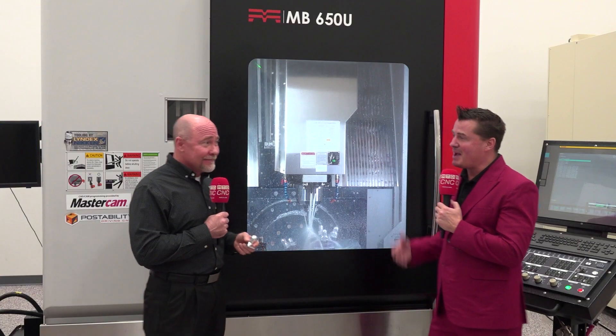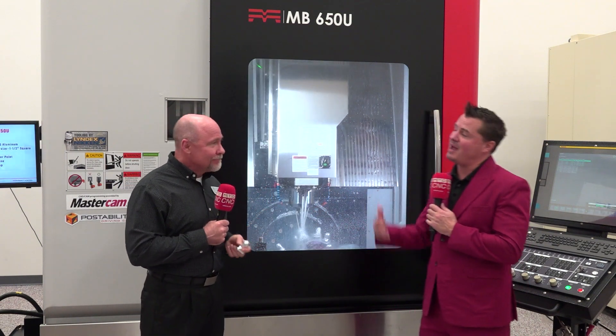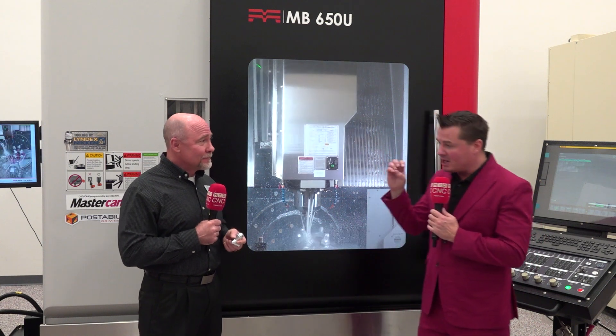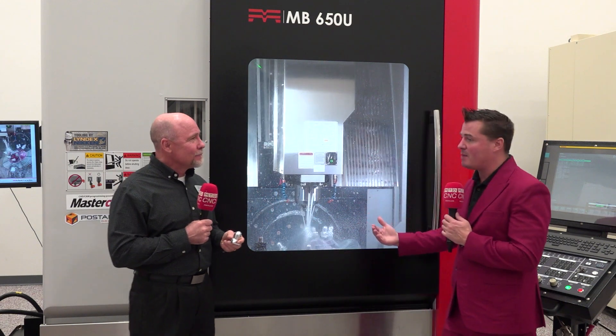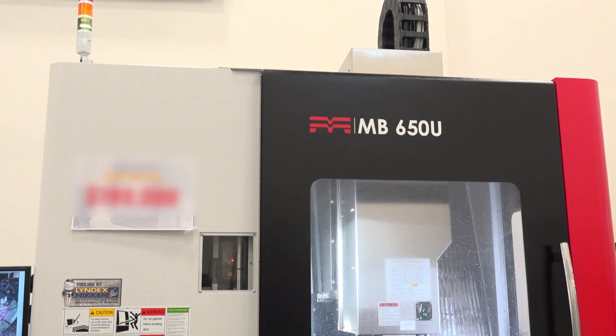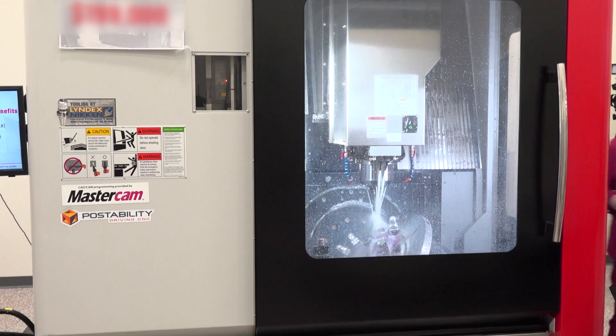Imagine this kind of cycle time and setup. That's a great point. You go from a three-hour cycle time to a 36-hour cycle time. Now you've got a day and a half of unmanned run time. That's the only way to make money today. The math is: if one piece is three hours, and then you do three times 12 — a lot of times when we're not being as creative as a Mandalorian, a cycle time will be a minute or two or three minutes, and the setup time will be equally as long, effectively doubling the overall setup and machine time. Whereas here, completely opposite.